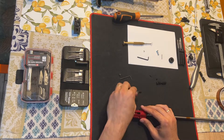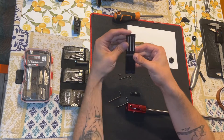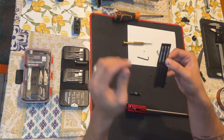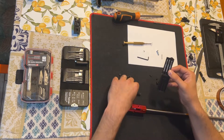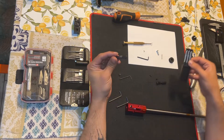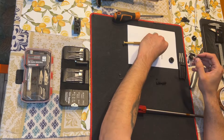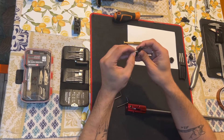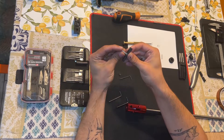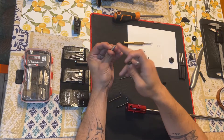For this project I also used — I don't know the name of these — but they are the ones that make the thread. I made a half thread through the plastic part, an M4 thread, so I could in the end place the M4 nut part and have just a little bit of resistance, not the resistance of a plastic part that is self-threaded.